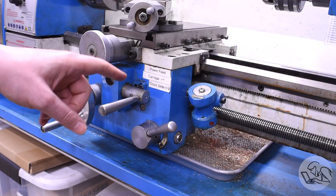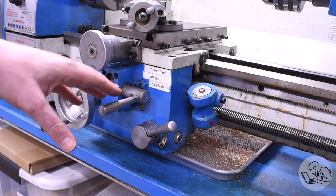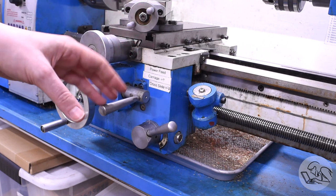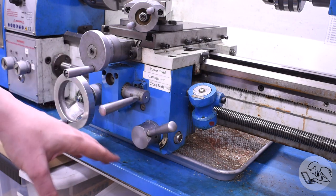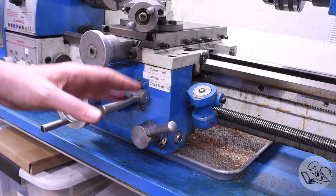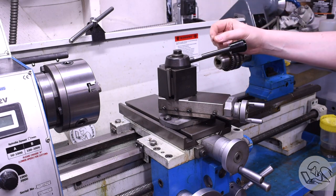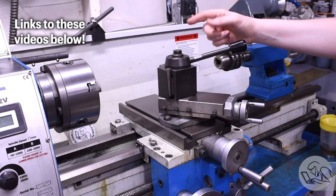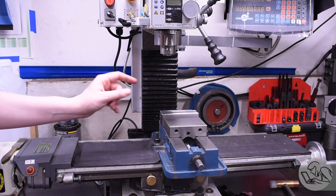The big no-no on machine tool gearboxes is: don't put automotive engine oil in them. Automotive engine oils have detergents in them because they are filtered lubrication systems — the detergents keep impurities and metal particles in suspension so they can be caught by the oil filter. Manual gearboxes like this are the opposite: they are designed to let impurities settle to the bottom, and there's no filter to clean them out. So you have to use an oil designed for manual gearboxes with no detergents, like 75W80 gear oil. When your machine is first set up, go ahead and make some chips — but shortly thereafter, properly set the machine up. For the lathe, that means leveling it and aligning the tailstock — I'll refer you to my video on aligning your lathe. For the mill, initial setup consists mainly of tramming the head and indicating in the vise — refer to my mill skills playlist for that.